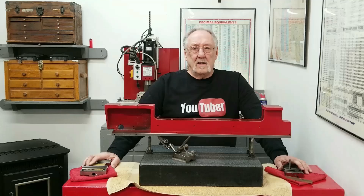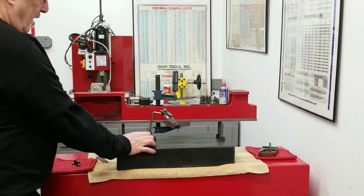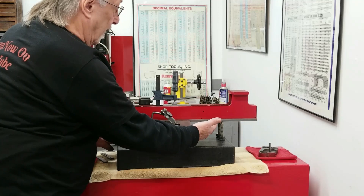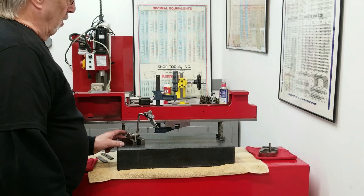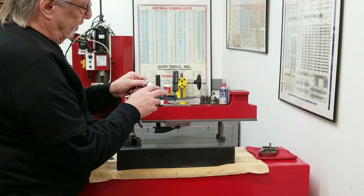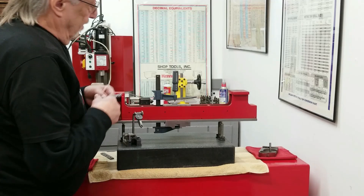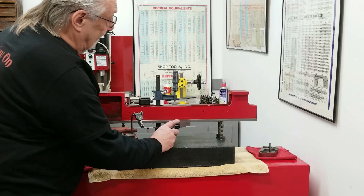Now that the bed is set up on the surface plate parallel with the surface plate, I want to clamp on the carriage. The indicators are all zero, so we know the ways are parallel with the surface plate. However, when I measure the surfaces where the gib plates are bolted, they're all cattywampus - all over the place, not parallel. I know why they have the opposing-screw setup to try to get an even surface, but that ain't going to work.